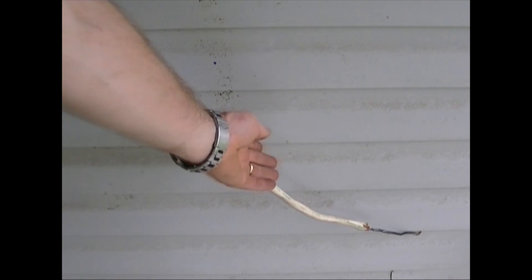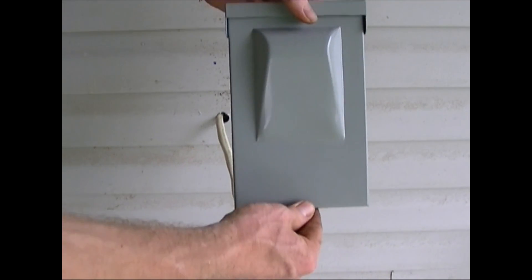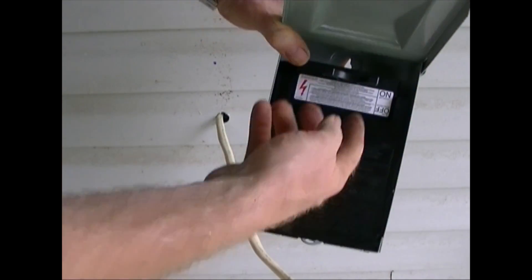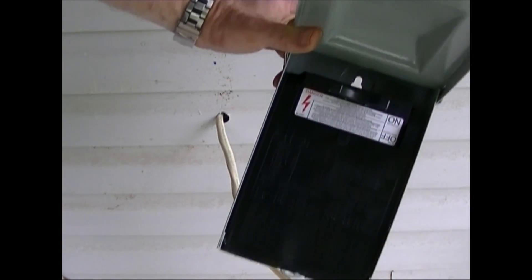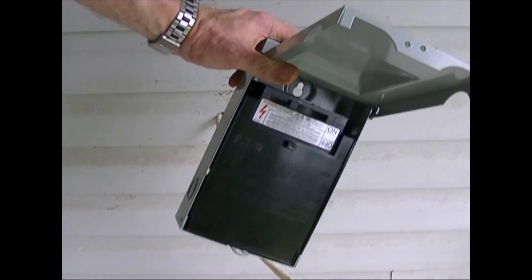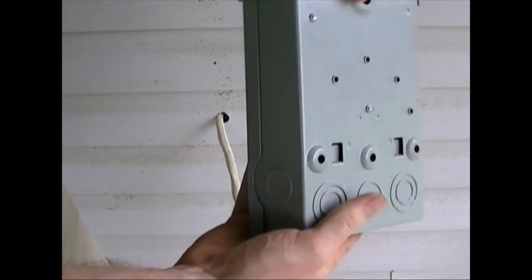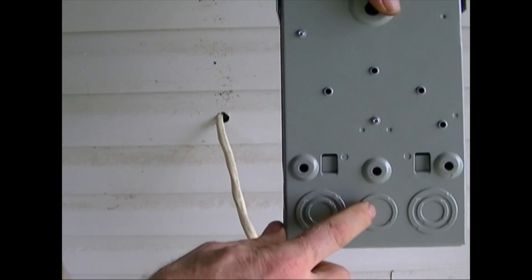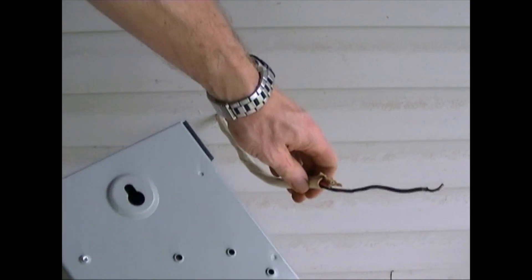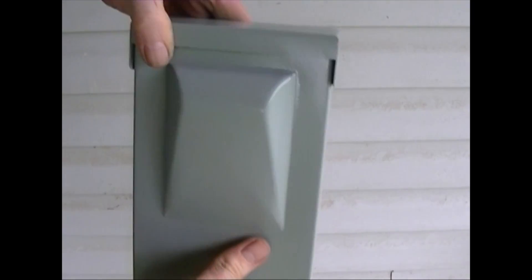From the inside, I poked this wire out and it came out through the siding. I'm going to install this cutoff box — it doesn't have a fuse or anything in it. It simply has a little handle that you pull out and that cuts it off, disconnecting the box so that the air conditioner technician can work on it and know that he's safe. On the back of this cutoff box there are punch-outs, also on the bottom, but I'm going to come straight out of the wall into this punch-out. I'll punch this out, poke the wire through, and go ahead and mount and wire up the cutoff box.